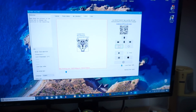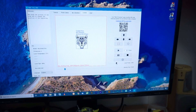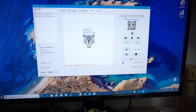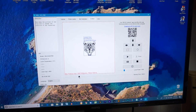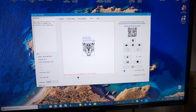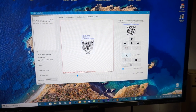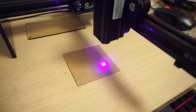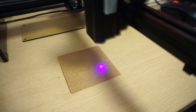After that, all you need to do is set the laser power — I'm going to set it to about 50% to start. Then set the burning speed; I'll set it to 20ms. After that you press play and your laser starts right away. It starts carving.